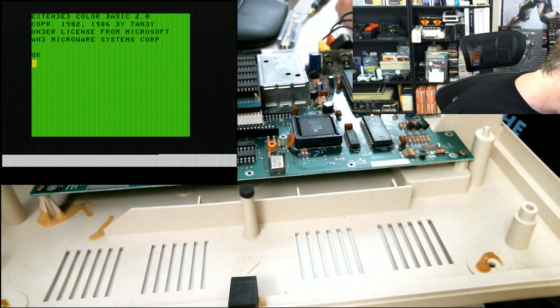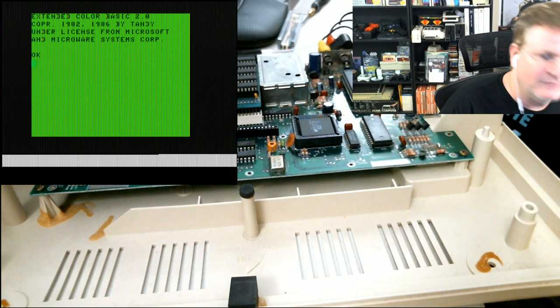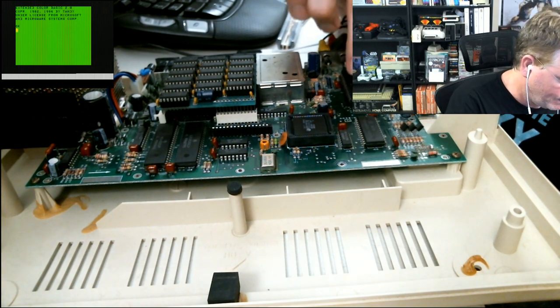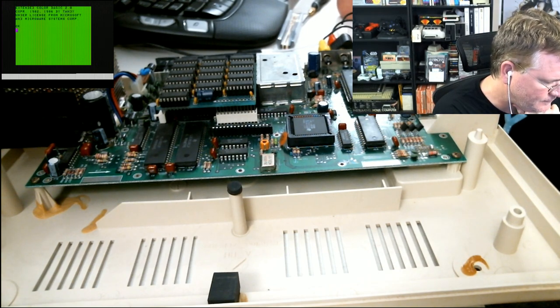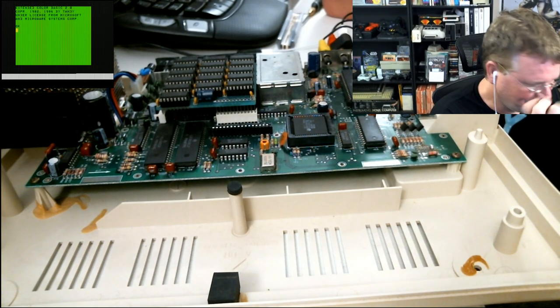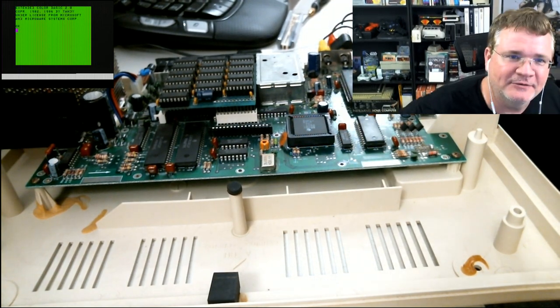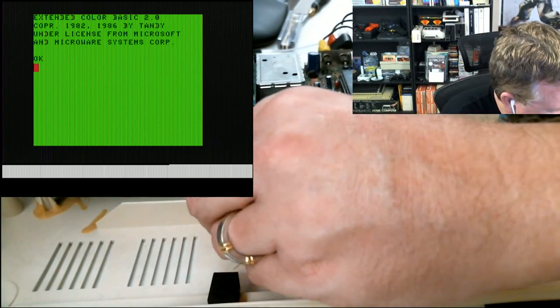I know that Mark Marlette sells something called the Protector, and that's supposed to protect the Hitachi CPU. Where does that go? Is that in line with the CPU socket, or does it go somewhere between the bus connection and the CPU? I think it just plugs into the CPU socket. So it's like a daughter board connection. It goes right on top of the CPU socket, and then the CPU goes in that. Correct. So it's kind of like a fuse or a circuit breaker where it'll kill itself before it lets the processor get killed. But with the prices of CPUs right now, that protector is like $25. I could go through 25 CPUs before I have to, pretty much, for right now.